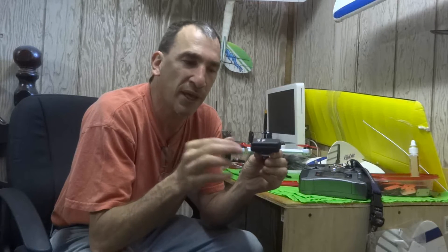Now what I've done to my camera: I modified the buttons so it stops the rattle I had — put a piece of tissue between the circuitry and the buttons. I also changed out the super thin piece of foil and put a piece of copper. Copper is a metal that will cool off the board a lot faster. I also put a piece of foam in the air plug area and cut it so it could deflect the wind and soften the noise.